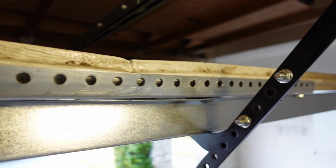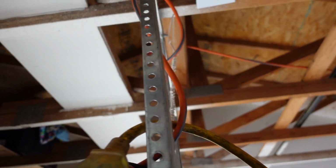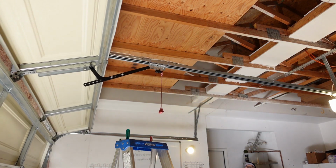Someone put angle brackets on the top section and all that, and that doesn't make sense because that is not a long-term solution. I see a number of these YouTube videos that say, oh, a cheap repair for your sagging garage door, $10. Yeah, but it just doesn't last, and quite frankly it's just going to cause you more headaches. So applying the punch angle for its correct purpose on the actual garage door opener, we were able to get the garage door opener straight.